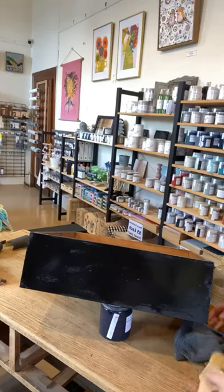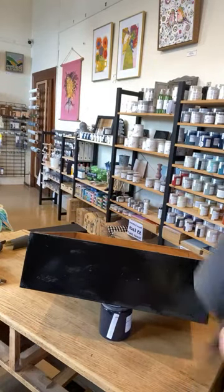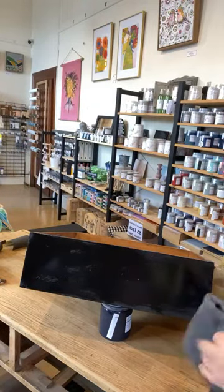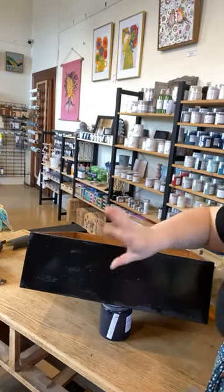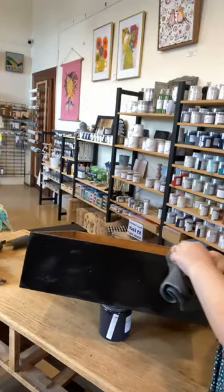Now, you can go in any direction you like, whereas if you apply a top coat, you need to apply carefully and in one direction. And this is why I love hemp oil and waxes. Any direction, you just want to get it on there. Now the key with this is not too much. Less is more in the case of hemp oil. When it goes through that curing process, if there is too much product on your surface, it's going to turn into a sticky, tacky, yucky mess that can be quite hard to remove.